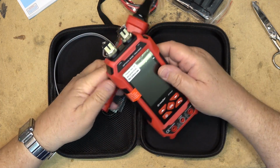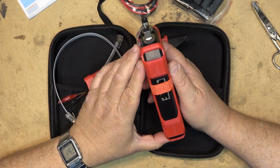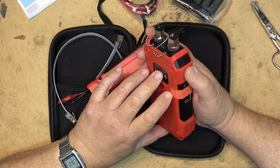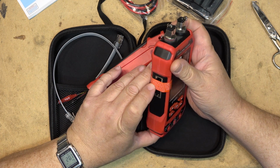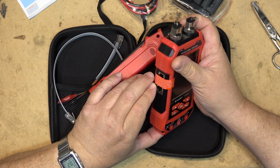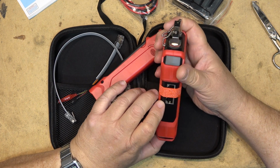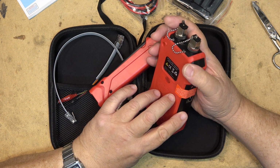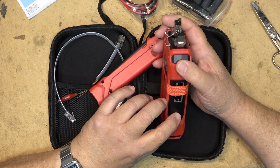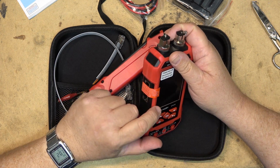it says please tear this off before being used. The length interface is only a length measurement interface. When this function is enabled, the other end of the network cable cannot be connected to any device such as a computer, switch, PoE, or other power device. Otherwise, the product will be burned. What, this or the other product?